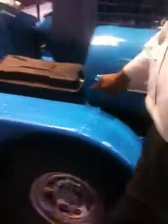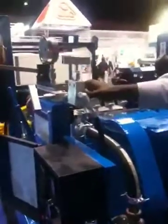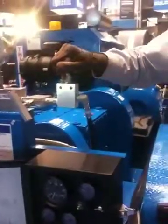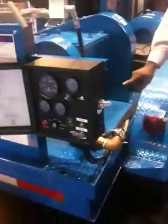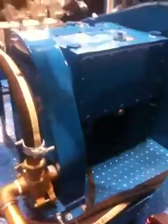All the way back we have the bypass, which is the bleed line. We have a double needle valve on the bleed side, which allows redundancy — you remove one up from the seat and then use one to bleed, making this your throw-away valve. We also have an auxiliary booster pump driven from the triplex via sheaves and belts, which supplies fluid from the reservoir tank to the triplex.